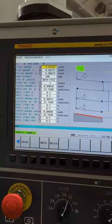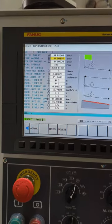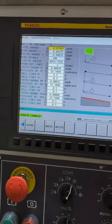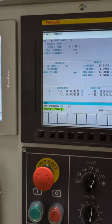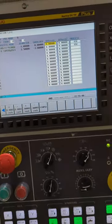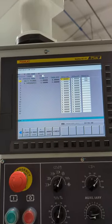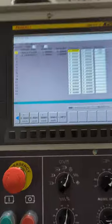And then there's my default speeds and feeds. Actually, feeds in stock. I don't have any speeds in there that I see. Yeah, I do, RPM. Use what you know. Most people already know what they're going to do, but there's the places you'd enter them. And then you just save. And then from here, I would offset based on the stock, because I used my print values. If I programmed off of touching it off and I had stock, you'd want to program the actual absolute values and then just offset down. But I programmed off the print values, and then I just offset that stock.